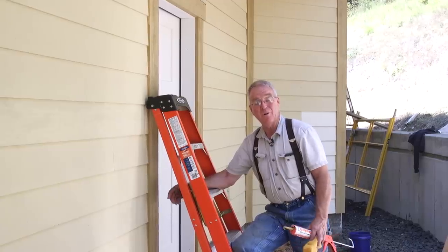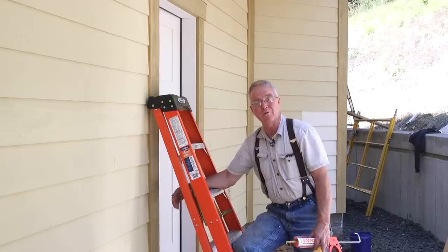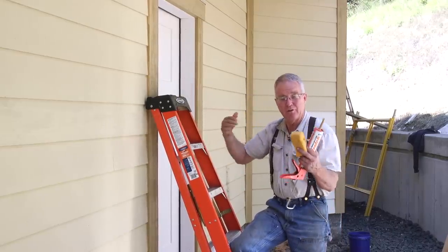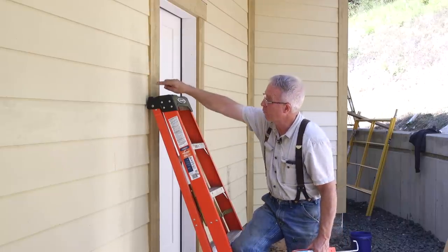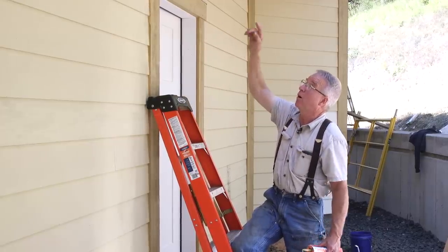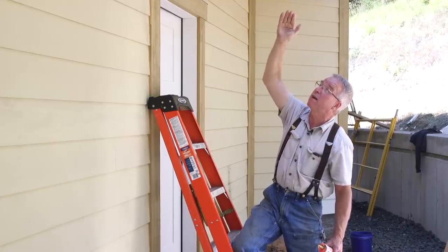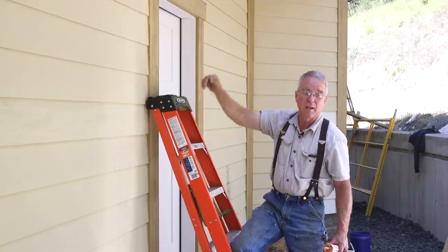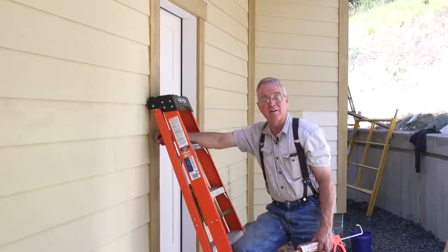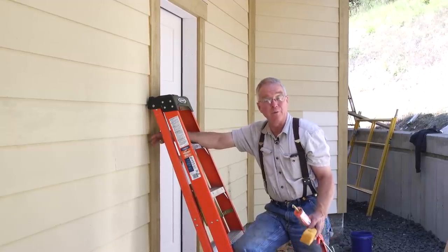Now, one of the things that makes this a really big caulking job is the size and the number of penetrations. We've got a lot of doors and windows and corbels and rakes and e-vents. And any time there's a penetration of any kind in the exterior envelope, like for instance right here, where this lap siding runs into the side of this door trim, or at the head, or around a light fixture where a light fixture penetrates, or where the eave blocks are bounded by the roof decking on one side and the siding on the bottom, anywhere there's an interruption to the lap siding is a place for water to get into your building. So that is going to take a carefully applied bead of caulking to stop the water, stop the bugs, stop the wind, and receive the paint.